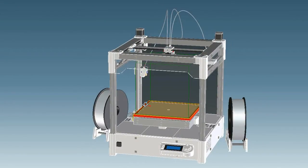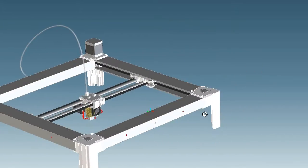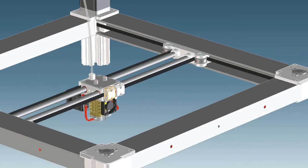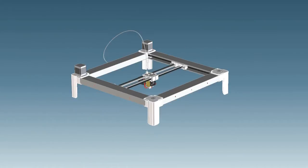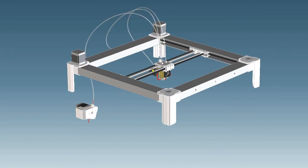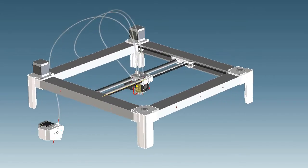I want this printer to be really fast. So the print head has to be as light as possible to reduce the forces that occur while accelerating. One way to achieve this is by a so-called Bowden extruder. This is nothing new — a prominent example of this principle is the Ultimaker. You want the extruder with stepper motor to be separated from the hot end and stationary to get rid of its mass. But the problem is, while the print head is moving, the tubes are bending, which causes the filament to be pushed out and pulled in a little bit. This can result in worse quality.